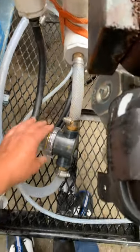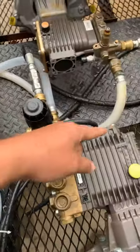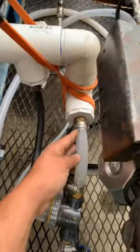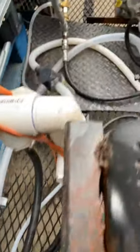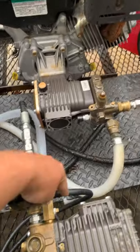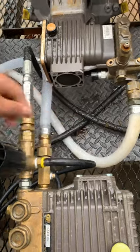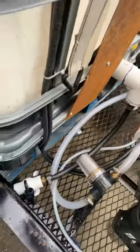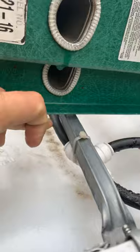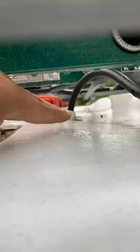I've got three-quarter-inch lines into General pump filters on each line that goes to each pump. This one comes out and goes around to that pump. This one comes around and into my General pump. Then this one has a bypass built into it — I've plugged it here, came around, and plumbed it up into a T, which then goes over into my tank.